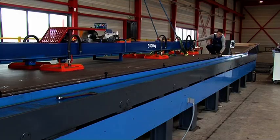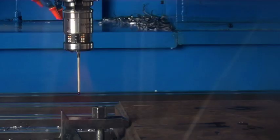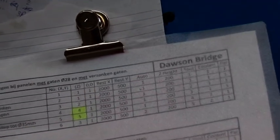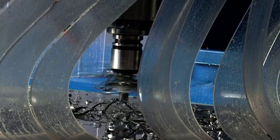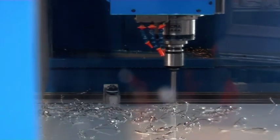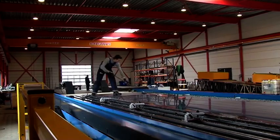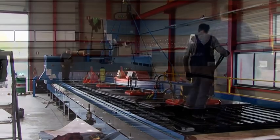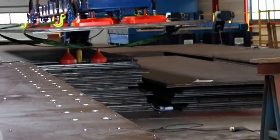The SPS panel now has sufficient strength to move it to the CNC drilling machine. The machine automatically drills all bolt holes used to connect the SPS bridge deck panel to the primary structure of the bridge and machines the threaded lifting holes. Over 16,000 holes were drilled for the 112 panels that form the new deck of the Dawson Bridge.